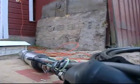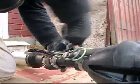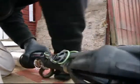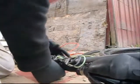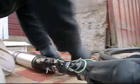All right, how's our sun timer? Oh boy, hungry and cold. I'm wrapping it up with this Plymouth electric tape. Wrap. Don't want anything abrading when it's in the hole on the steel casing. This pump turns on and off every time the 20-gallon drawdown tank gets drawn down. I actually had a monster roll of tape at the house. I should have brought that extra wide.